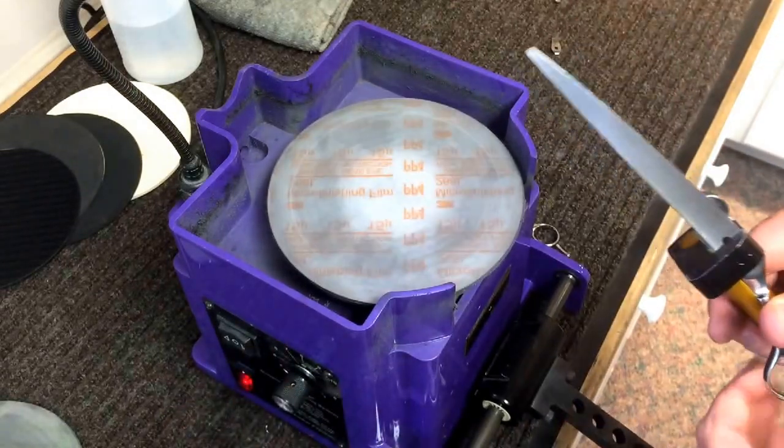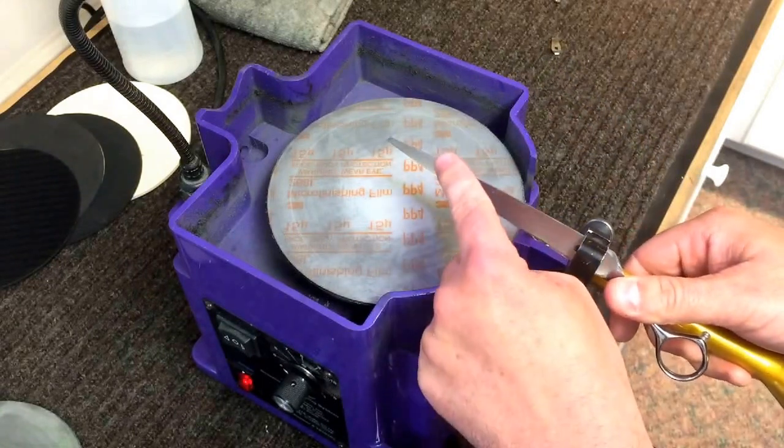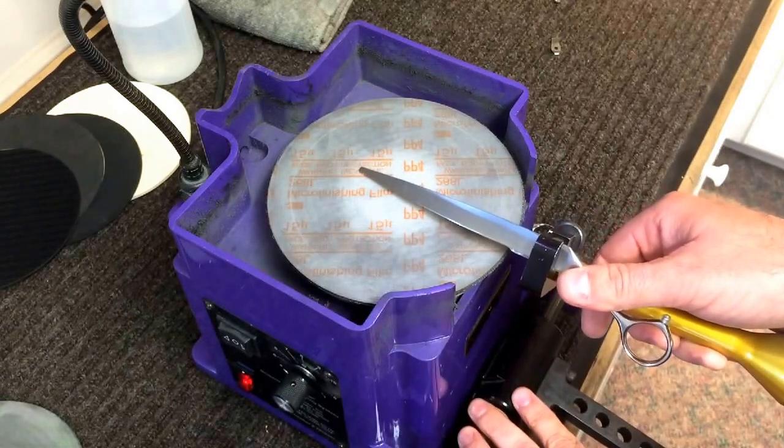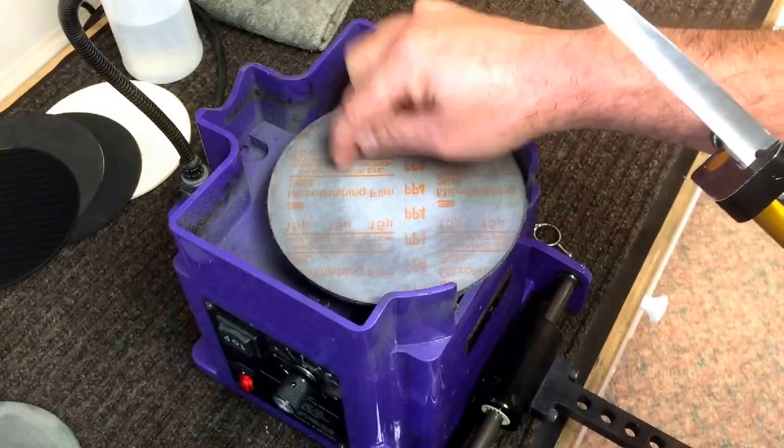When you do the polishing on the front surface, it's much more forgiving as well. The trick is just to make sure that when you have your curved blade where the tip is curving downward, you don't touch the other side of the disc from the center — otherwise you're going to cut into the tip. It's pretty straightforward sharpening a convexed beauty shear or dog grooming shear on the Heretu or any other flat hone. If it's curved, typically you won't run into many curved beauty shears, but occasionally you will — especially for some used for the helix style of cut.